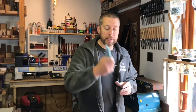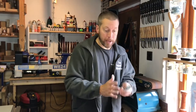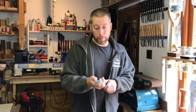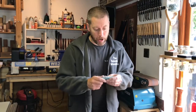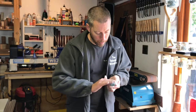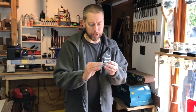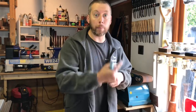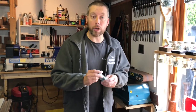I was so excited that I started sanding away and forgot about the video until Christopher reminded me. We're now going to sand thoroughly, starting at about 240, 320, 400, 600, 1000, maybe even up to 1500 grit, to try and get a really good clean finish. At the moment I'm on rough sanding paper and it's looking quite dusty, but hopefully as I work up through the grits it'll start getting smooth and show good color and texture.